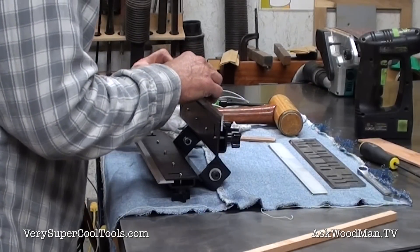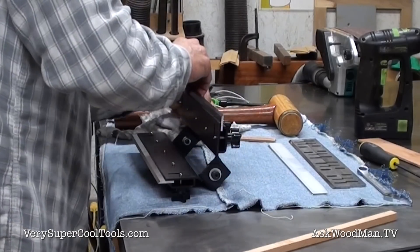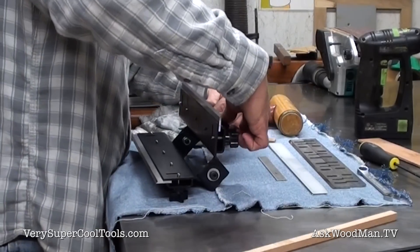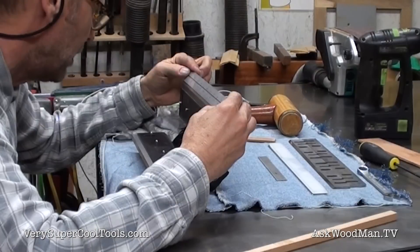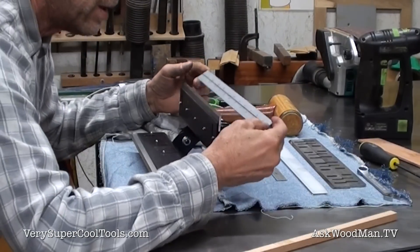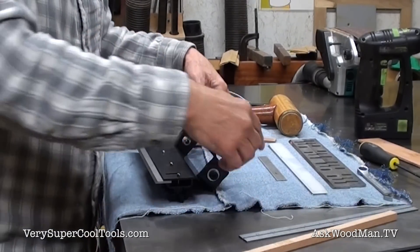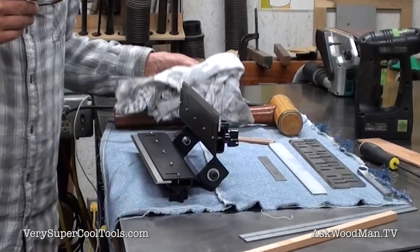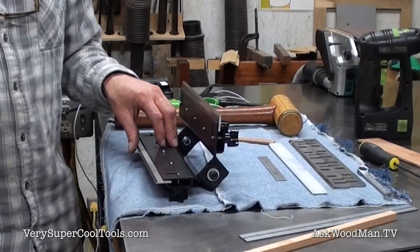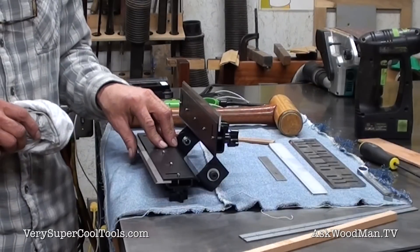I hit it just perfect right off the bat. Looking at these knives for straightness — it's probably not a thousandths at the end, but these were not straight. They will be straight after we're done passing them on the granite surface plate with abrasives. We'll start with 150 grit paper, then 220 and 400, and then go on over to the film.